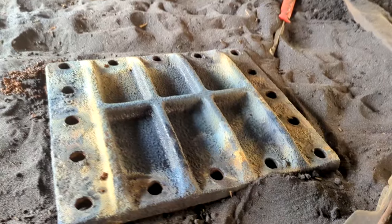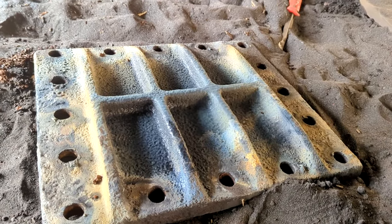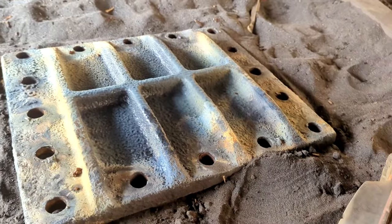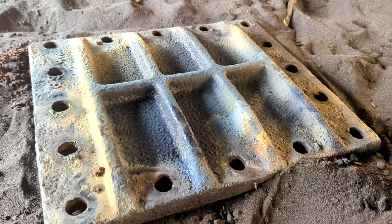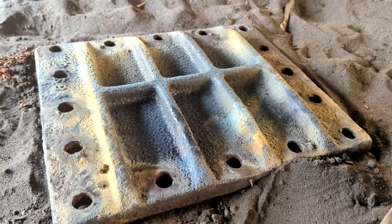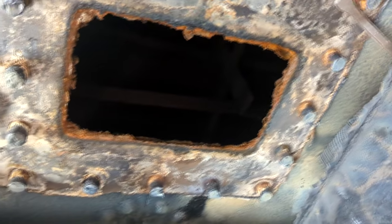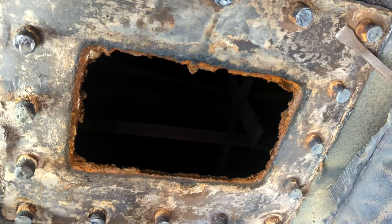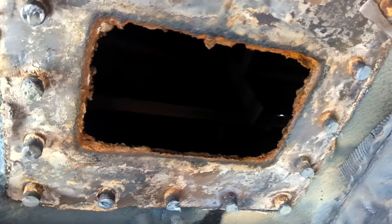After that slight tripod malfunction, camera's fine, so that's good. This plate is out. This would have been the blocker plate for the water scoop for the tender, if it had one — I'm not entirely sure this one had one. I'll show a couple of reasons why when we compare it to another engine out in the yard. Basically the dead giveaway is there's no old apparatus visible on this tender. It might have had the option for it, and where this locomotive operated would have dictated whether it needed one — maybe if it was regulated to yard or short local runs it wouldn't have had it. I'll replace all these studs when we bring it into the shop for restoration.